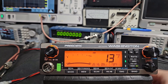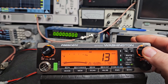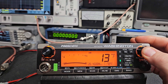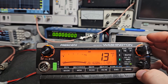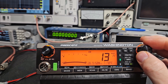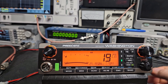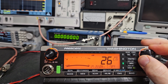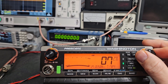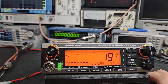For CB, you're probably not going to want to use that span setting, so you would just turn it off — hold this down and it goes back in, switch that off, and then go back to CB band. That's basically the same usability as your George, minus you're going to have the A channels. There are only a couple of A channels in this band. Your George FCC won't get those A channels, so just remember that.